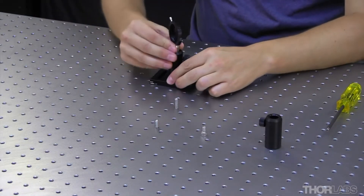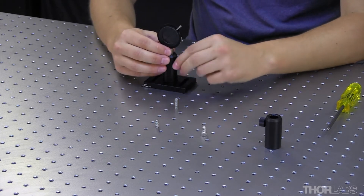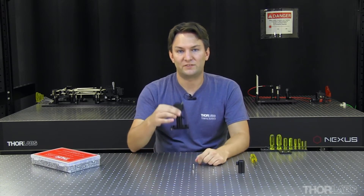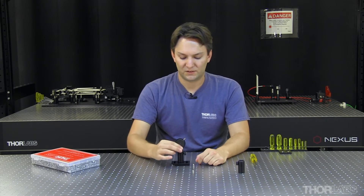In addition, as I'm doing my alignment, I may find a spot that I think is optimal. I'll lock it down. When I start my experiment, I find out that I need to move it a little bit. And when I loosen and try to move that iris, I find that I've actually attached the post to the bottom of the post holder — the post has threaded onto that screw that is now sticking up.